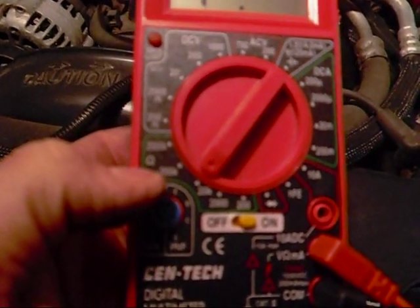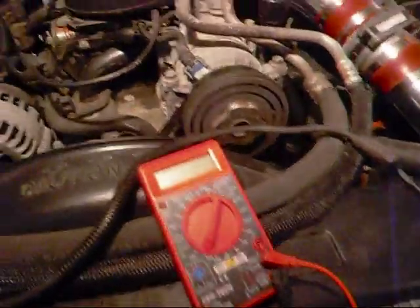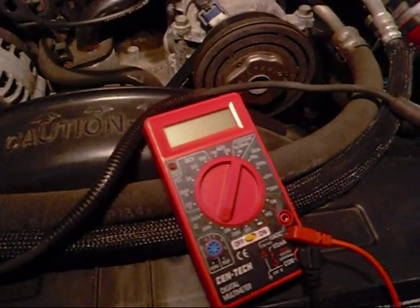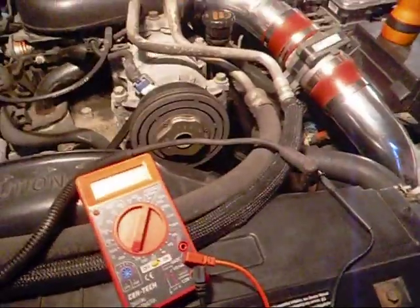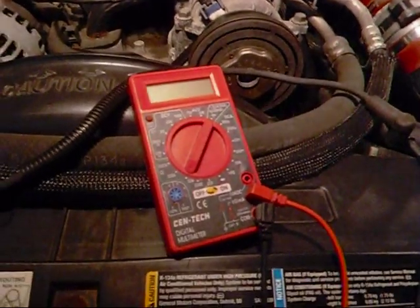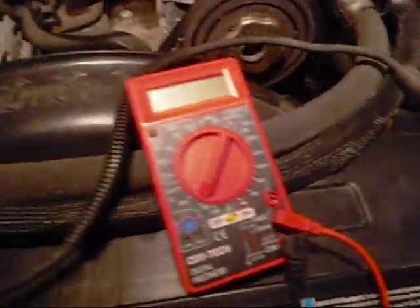The specs vary — they said 12-inch wires should be at least six to seven thousand ohms, and it shouldn't be more than seven or eight. The wire shouldn't be under six. Longer wires obviously have higher resistance — they said something like 30-inch wires should be around 9 to 11k. But these are reading two, so...